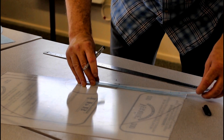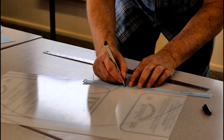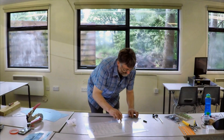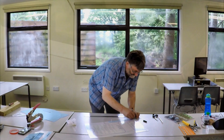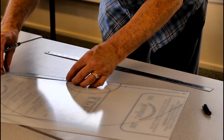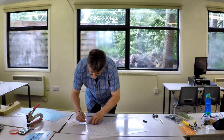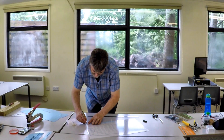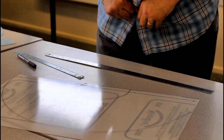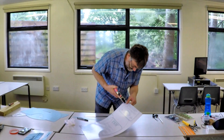Now the position of the holes. We line this up so we can see what we call the little A and B holes, and mark really, really carefully where those holes are, because the position of these holes is what determines the shape of the cone. Now we quickly punch out the A and B holes.